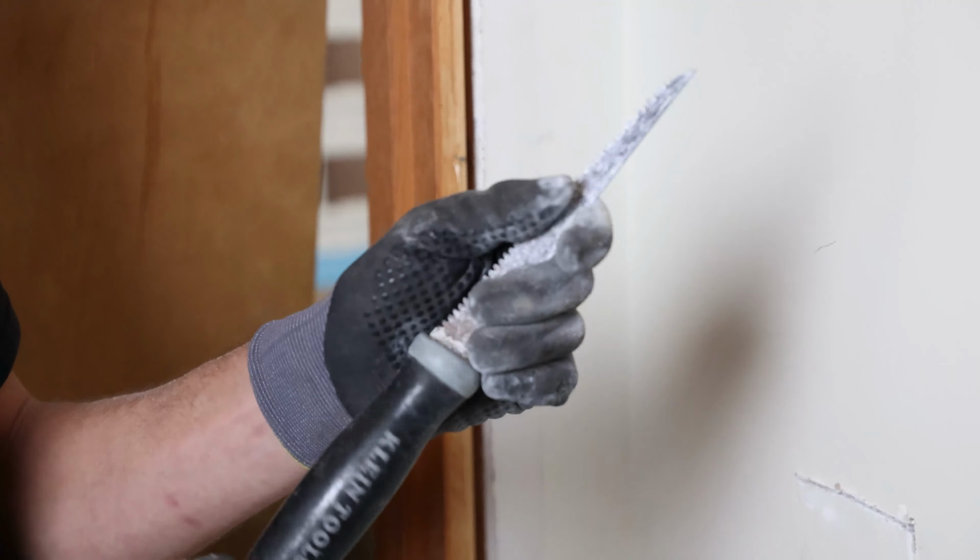All right, so we think that the light stops on this side of the beam, or maybe just on the beam. What I'm doing is I'm going through and sending the end of that wire to the other side, just in case something changes. Cabinets don't show up as expected, and that moves 2 inches. I'm now not on the blind side of the beam. I've been taken care of. I am gonna cap this lightly, like we've been doing, because you just never know. We make provisions for the unknown to the extent that we are able.